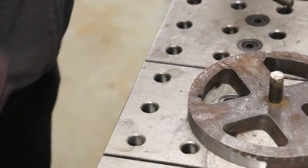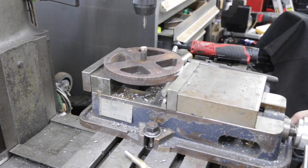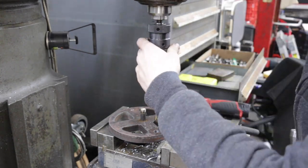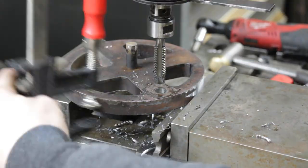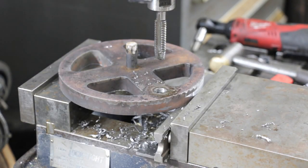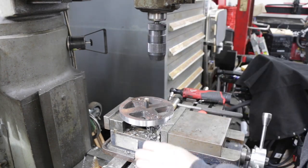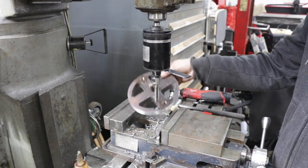I'm able to cut the pin off at this point — it's still friction fit but it's definitely plenty good to just sit in the bottom of the vise. Back in the machine shop on the Bridgeport, I use a center spotting drill to start these holes, then chase them up to a larger size and drill the tap hole for a 1/2-13 tap. I'm using a Tapmatic to tap these holes — a Tapmatic is a self-reversing tapping head, so once you pull up on the quill the tap reverses. It's the fastest way I've ever found to tap holes. This is solid 3/4-inch steel plate and I was able to tap a 1/2-13 thread in just a couple of seconds in one pass. This model is a 50X and it's honestly paid for itself a hundred times over.